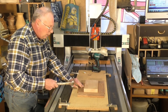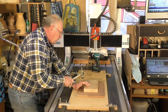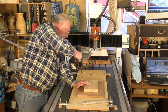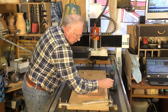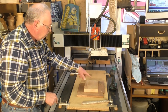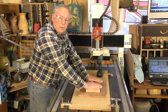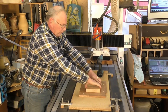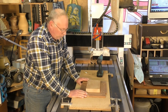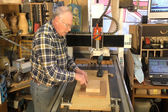Start the screw with a hammer so the material doesn't wander when you start to drill it in — it always keeps up tight against there. Same on this side: squeeze it up, put screws in, and then we'll set up the work offset zero. After five minutes or so, this is now very firm within this boundary box that we've put our material in, so you can machine this without having any screws actually in your material.